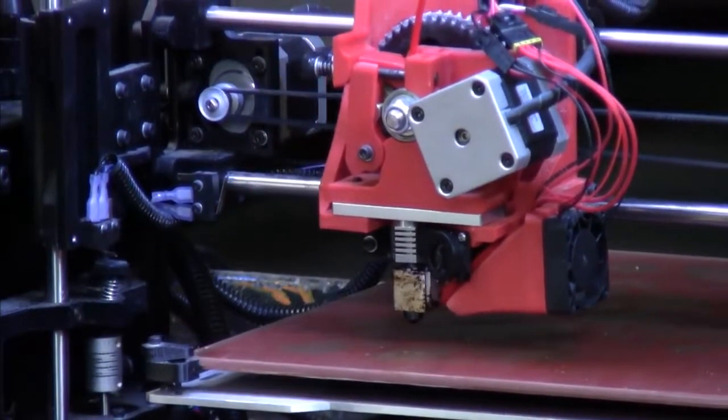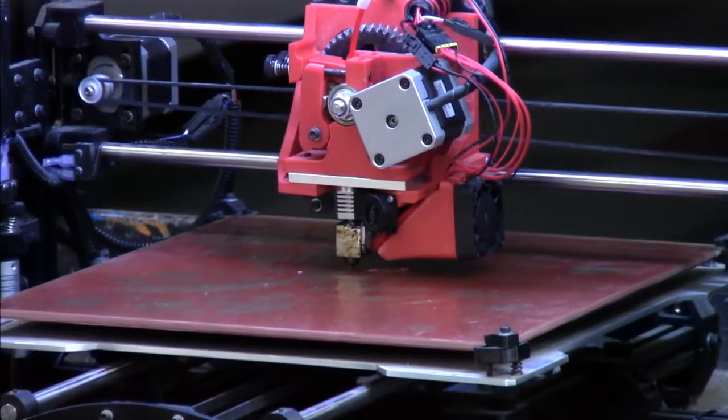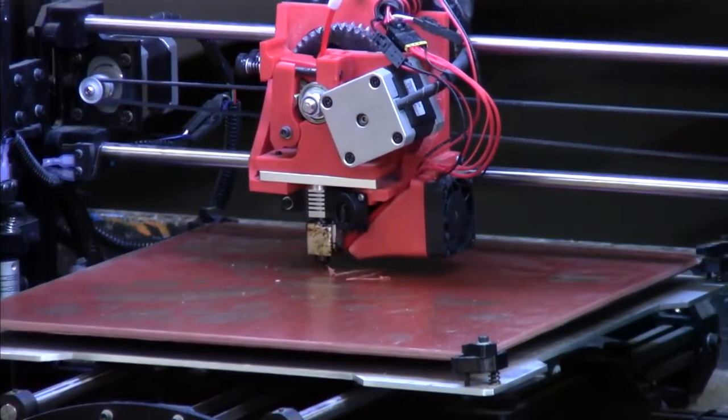So as that's going, as I said, there are a couple of different profiles available, both in temperature and in G-code settings, and I'll get into that in a little bit. And each different one covers a different material. PLA, it's a polylactic acid, that's a corn-based plastic. ABS, which I said is the most common, that is acrylonitrile butadiene styrene. It's a very common industrial plastic used in basically every consumer electronic ever made, at least in modern history. High impact polystyrene and many others to be sure.